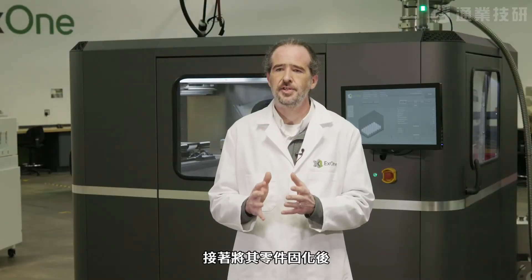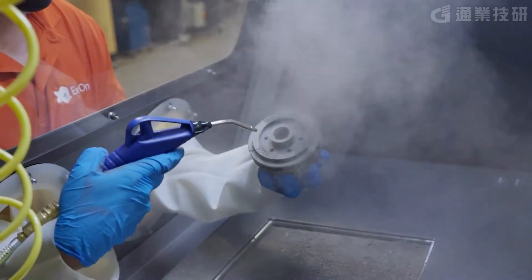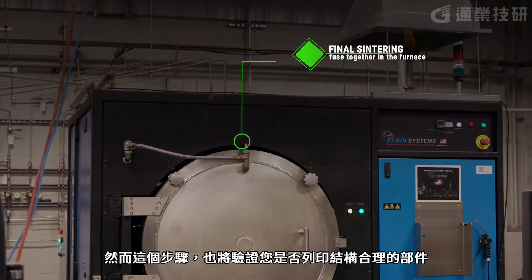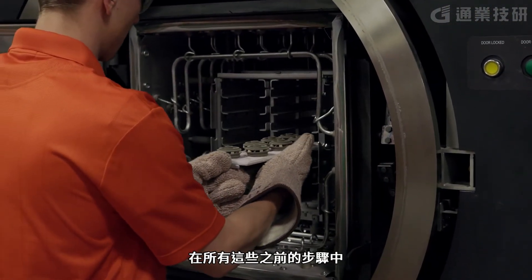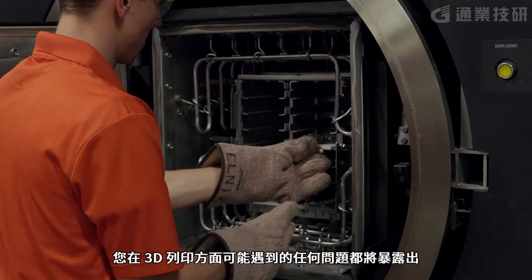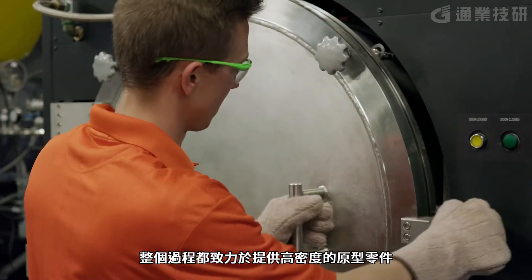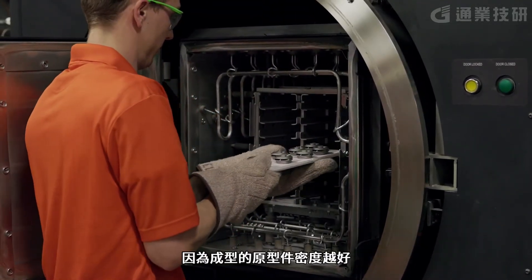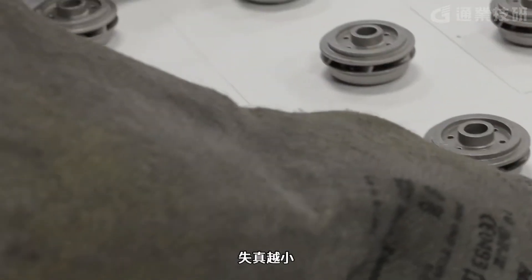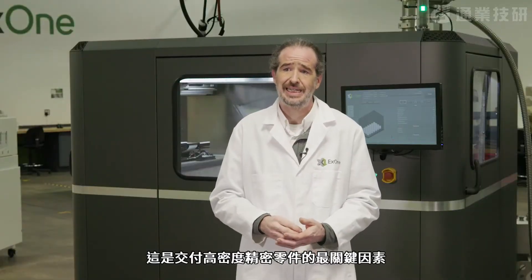After your part's cured, you need to remove it from the powder bed and prepare it for sintering. Sintering is the final step of the binder jetting process for metal — it's also the step that really proves whether you've printed a structurally sound part in all those prior steps. Any problems will be exposed in sintering with poor results. That's why our entire process is tightly focused on delivering highly dense green parts, because the better your green density, the lower your distortion, the lower your shrinkage, and the tighter your tolerances. It's the key to delivering a high-density precision part.